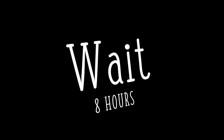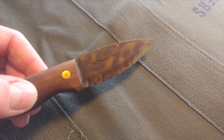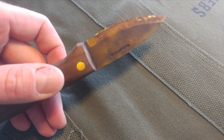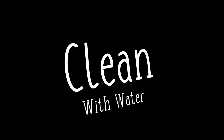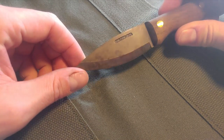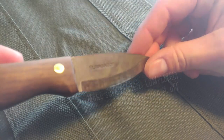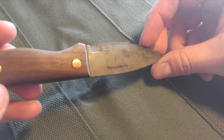I fell asleep, so this one was on there for about eight hours, which gave it enough time to work. You can see through the mustard how dark it is — it's darkened up significantly. After rinsing it off, you're going to want to make sure you rinse it with water to neutralize the vinegar and stop further chemical reaction. This time it's a lot darker than it was — the eight hours definitely helped. It has some darker spots from varying thicknesses of mustard, but it's almost got a stone-like appearance to it.